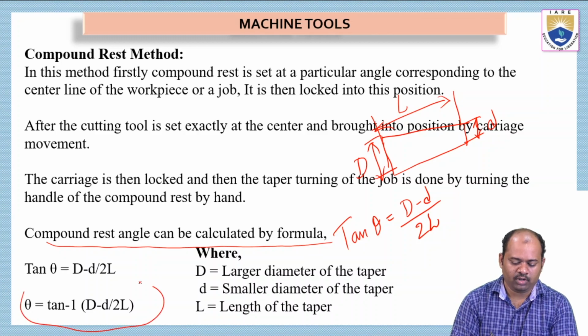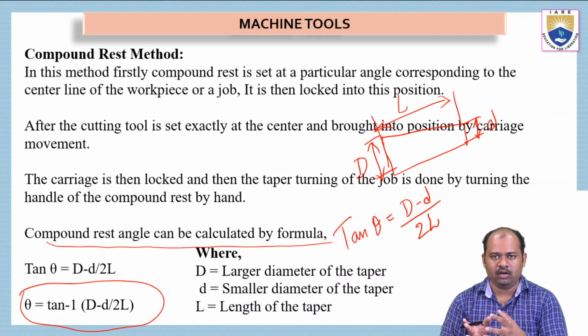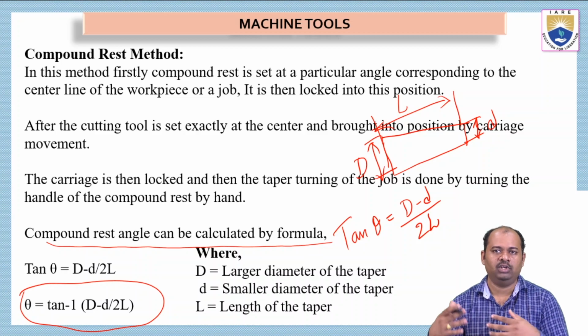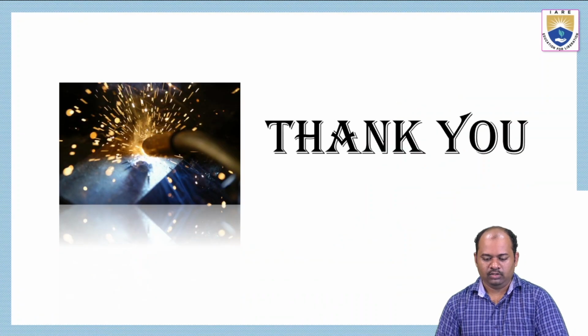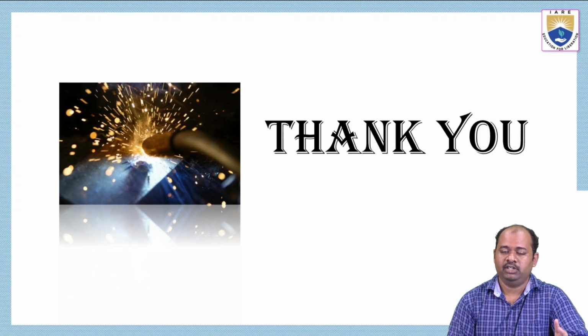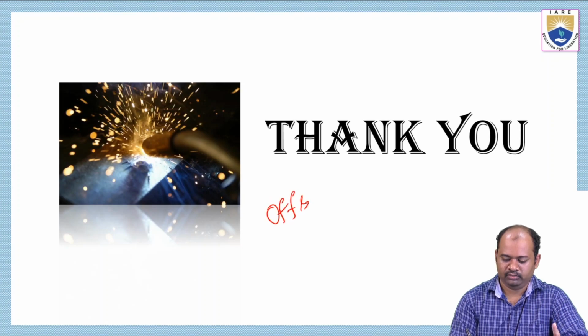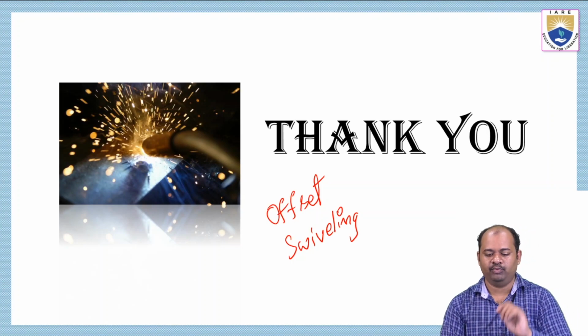So by using this formula, we have to calculate theta first, that means the angle of the taper. Using this angle, we have to rotate the compound rest along this angle, and then we can do the operation by simply getting the taper turning. Okay, so that is all about the different methods of taper turning used. We have seen two methods, that is the tailstock offset method, and then the compound rest swiveling method. These two processes are very important and have to be studied with greater importance.